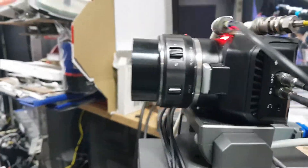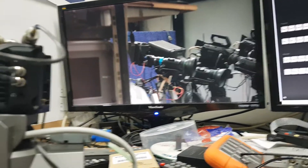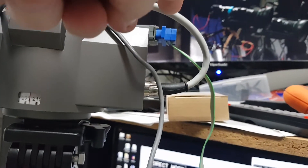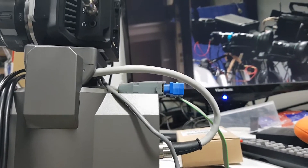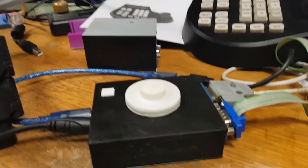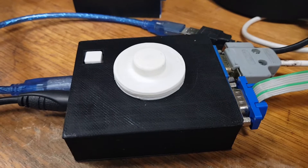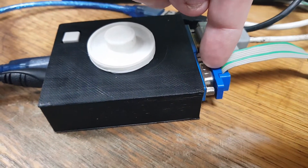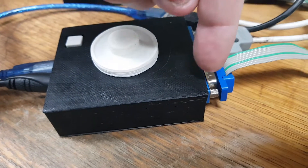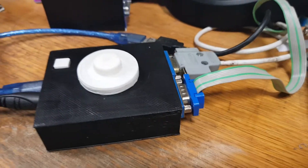This is currently running through an ATEM and there's the picture from it — that's the output of the camera. The magic is all done at the other end of this cable here. This is just an RS-485 or RS-422 connection, depending on what you want to do, going down a cable and plugging into the controller box. The cable from the box to the camera can run up to about 10 meters, though RS-485 can go 1.4 kilometers.